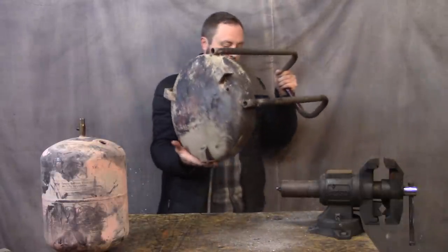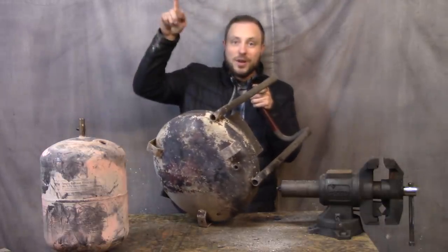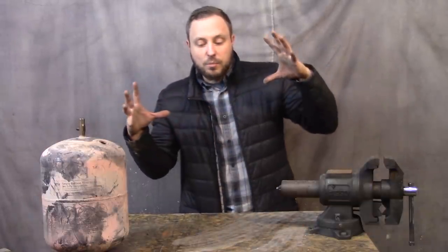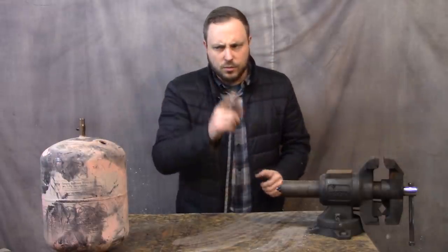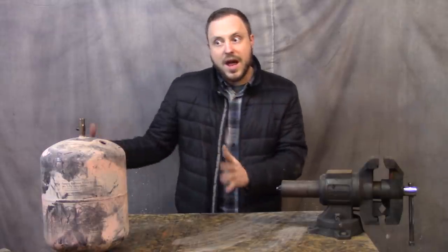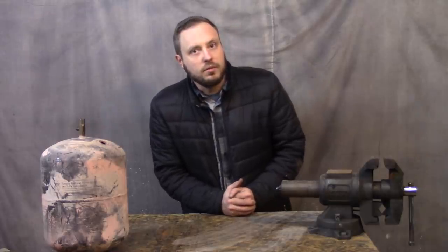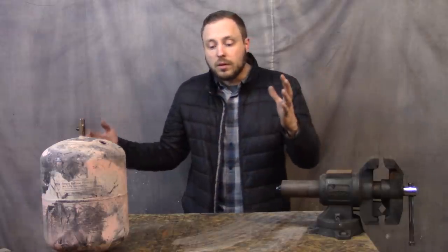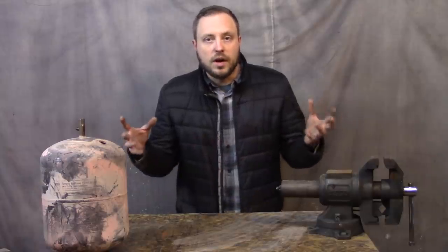By using the pancake compressor I can keep my burn chamber in a really small area but still have a relatively large burn chamber. The cool part — and why I'm excited — is what I've decided to do with the mass portion. I haven't seen anybody else do this, but I think it's going to work very well: I'm going to build it vertically. Nobody builds it vertically because the heat rushes up out of something vertical so fast that it doesn't have time to warm the stuff around it and dump all the heat energy into your mass. But I think I've figured out a way to fix that.